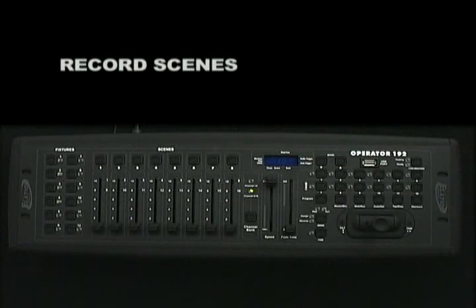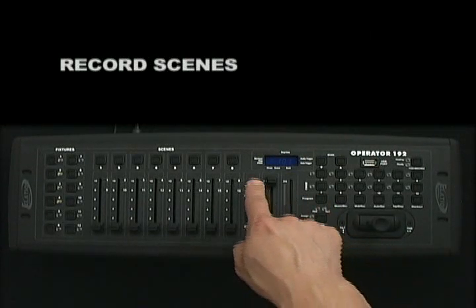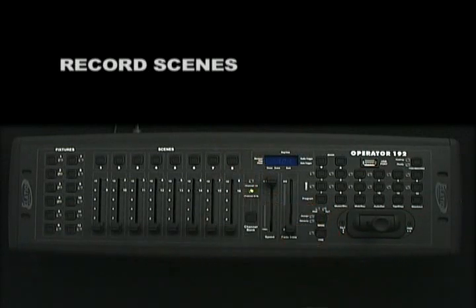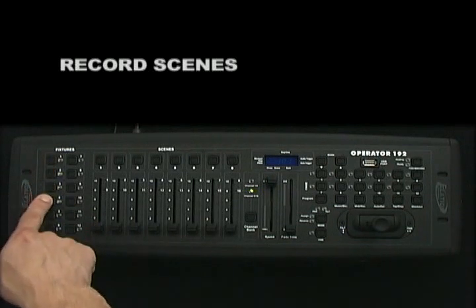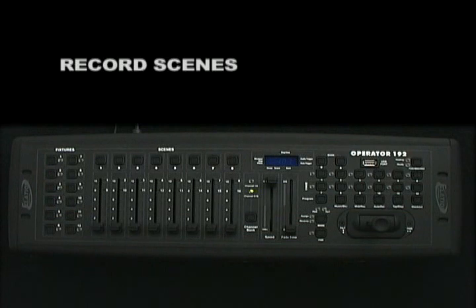To program scenes, press and hold the program button for 2 seconds to enter program mode. A small indicator next to the program text will come on. Next, select the fixtures that you want included into your first scene. I'll deselect fixtures 2 and 4 so that fixtures 1 and 3 are the only ones selected.